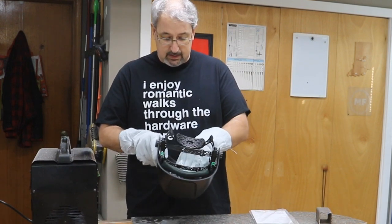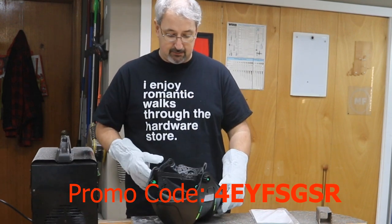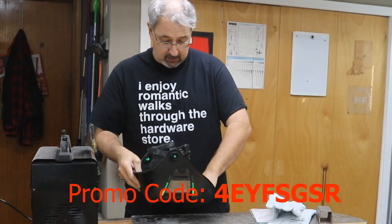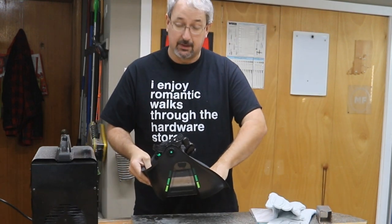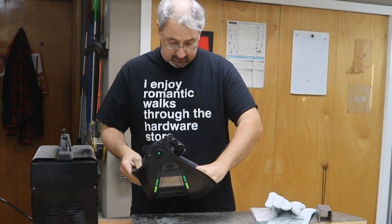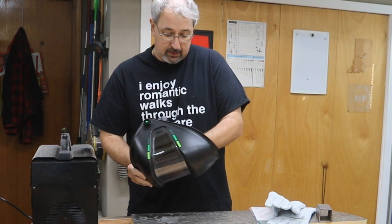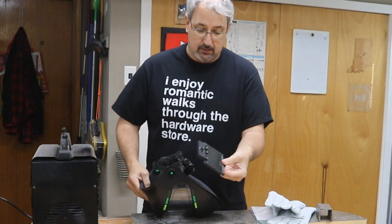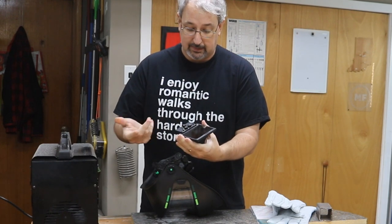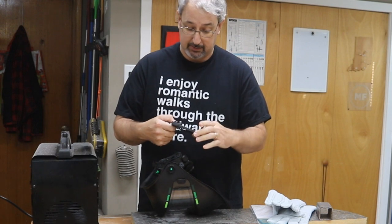On the inside, it is auto-darkening. The whole mechanism pops out real easy — it has a thumb screw inside — and you can pop the whole mechanism out and change the glass if you need to, real quick and easy. There is a little plastic guard on there as well to protect the main screen. This whole assembly comes out; there are a couple batteries in here. It is solar-powered, so in theory you should never have to replace those batteries, but you may have to charge them up a little bit.